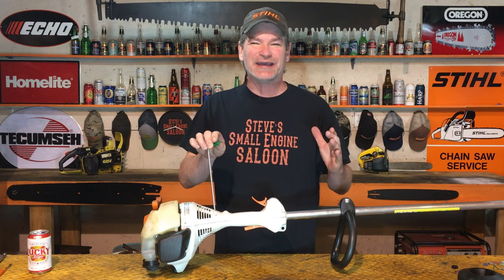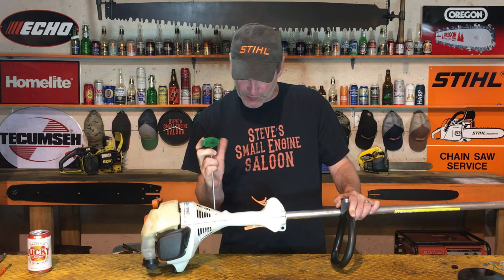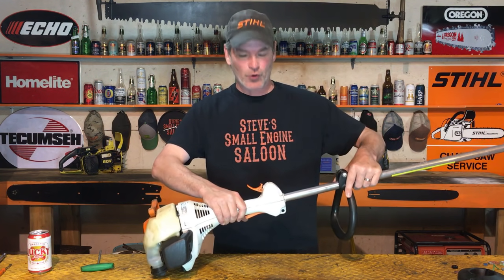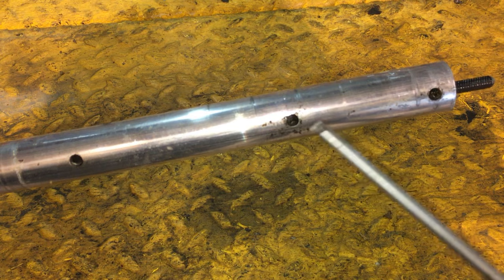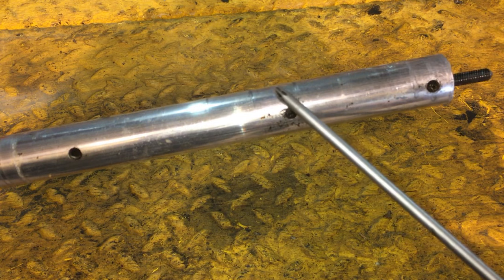It's a short screw that goes right into the hole in the shaft - it's kind of like a locator pin. You unscrew that; you don't even need to take it out, it's pretty short. Loosen it off quite a bit and there you go - now it's out of that hole. Pull that right out. That's the hole that screw was in right there - that's your locating hole, so remember that for when we put the straight shaft in.